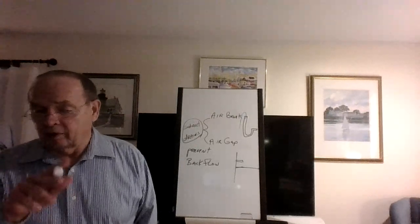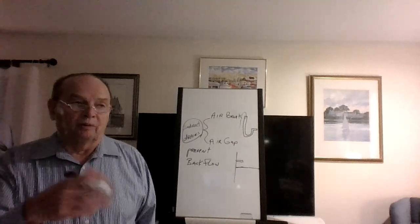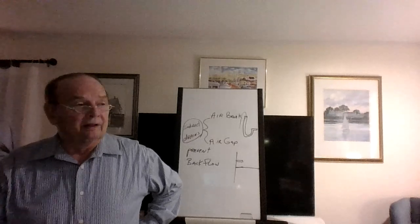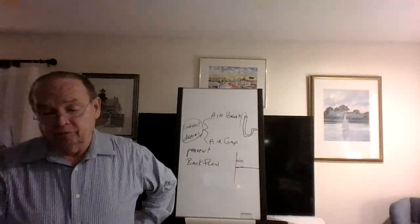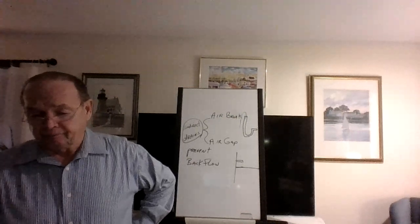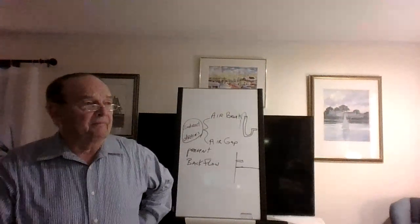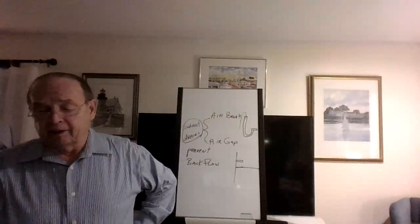Okay, I think I told one of the 2 groups, tier 1 and tier 2, that one time I did get involved because somebody forgot to do this, and I actually helped the electrician. We did it together. It was aluminum smoke pipe, which I had never used before, never seen before, for the part of the ventilation. But just be sure that it's taken care of. If you see somebody putting in a light with no ventilation, especially if there's no window in the bathroom, speak up.